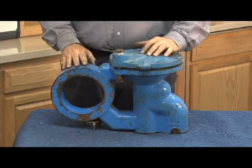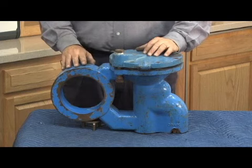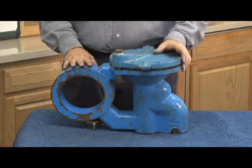So we've seen the 3/4 through 2 inch bronze body unit. Now we've seen the flanged units in the 709, which is the double check assembly, 709 DCDA, which is double check detector assembly, 909 and 909 RPDA, reduced pressure detector assembly.